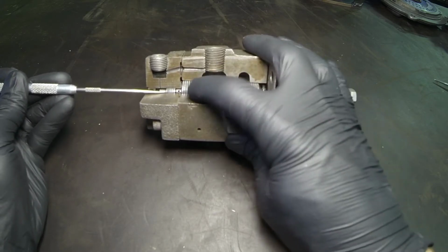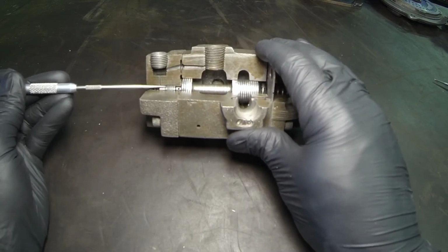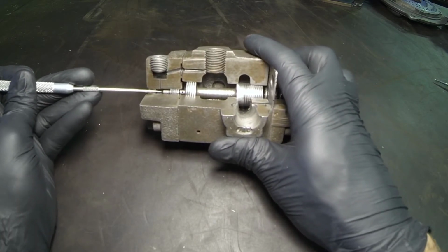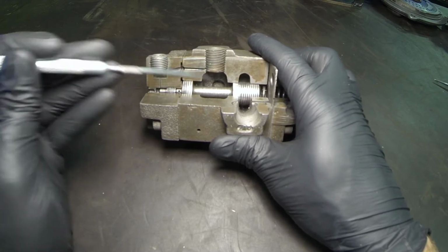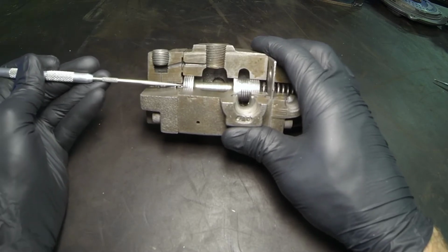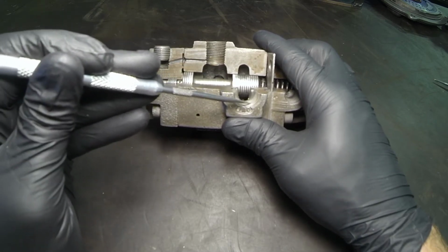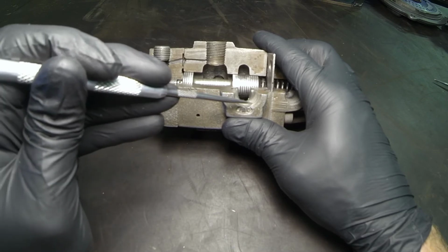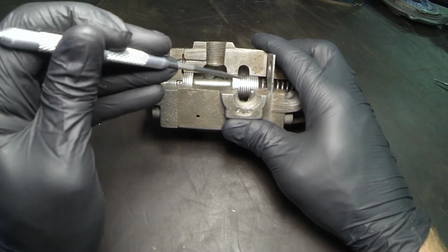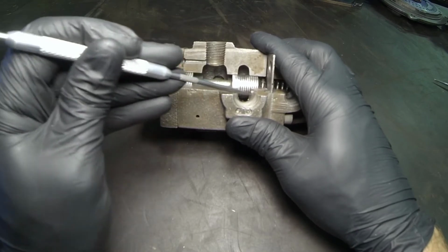Now, when this little poppet, or the larger poppet inside the spool that's inside the valve, really, get the terms right, when that spool lifts up, what ends up happening is we will lift up far enough because the pressure is built up at the dead end of the cylinder on this side. Pressure builds up enough to lift up this spool and actually connect that same work port A to an additional cylinder right here. And then that additional cylinder would be able to extend out until it bottoms out and/or carries a load. And then both of those pressures, as they extend, would equal pressure to both of those cylinders.